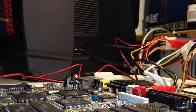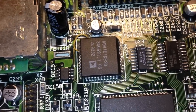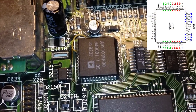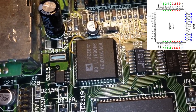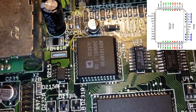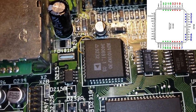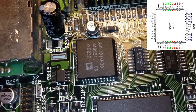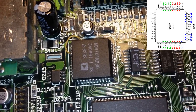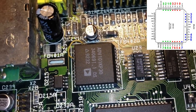One of those pins. So it has come down to two pins now. We have already eliminated the other ones. But which one of those two pins is the one that is causing this problem? Is it either B3 or B7? Well, we cannot really use the logic probe to find that out, because the data bits on B3 and B7 are both behaving the same. So the logic probe is really no good to us anymore.